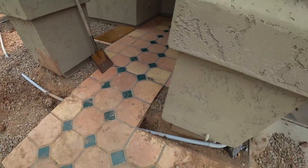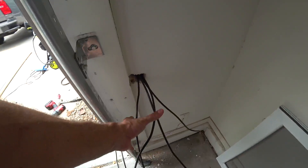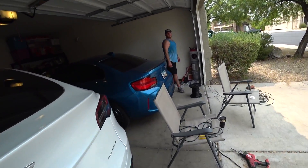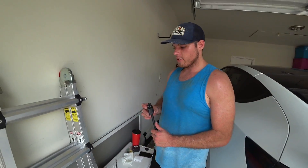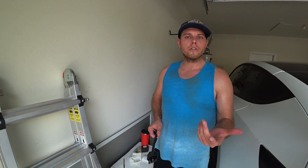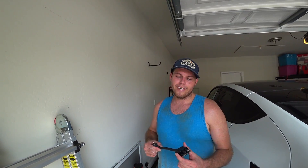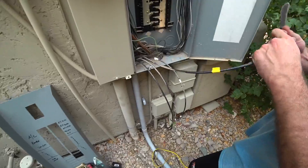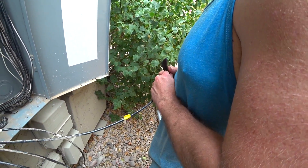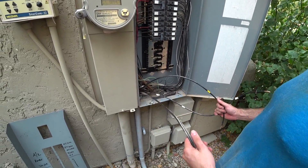All wires are put through, nothing connected yet. Had some trouble getting through the wall, but not nearly as hard as going under the sidewalk. Now all four wires are through. According to the spec on the Tesla plug, it's a normal 220, but the way theirs is wired there's a neutral, two hots, and a ground — which is pretty typical. A lot of 220 stuff like your dryer doesn't need a neutral, so that's why people don't normally see four wires. But it's pretty standard stuff. So it's just white to white, green to green, and then the two hots go on the breaker.